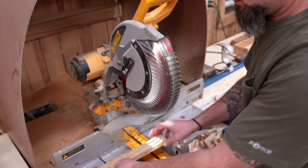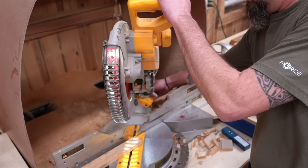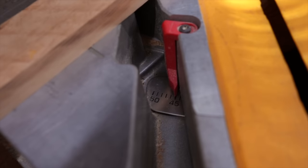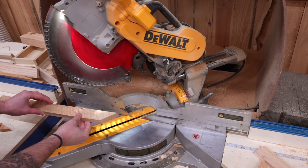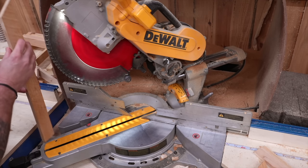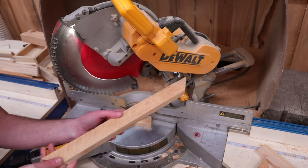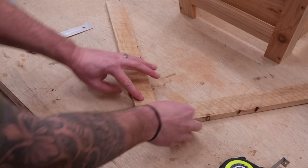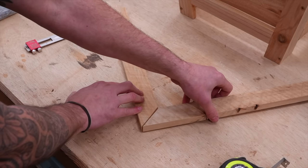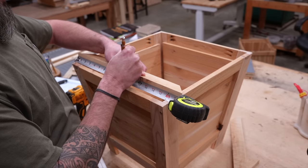To cut our top trim we're going to use a miter bevel — don't freak out, I'll walk you through it. Set your miter at 45 degrees to the left and your bevel at 8 degrees to the left, so your saw plate looks like this: 8 degrees and 45 degrees. These will be labeled Part M on the cut list. Once you've made your first cut, flip the board over leaving the longest points against the fence, then change the bevel to 8 degrees to the right, leaving you with a 17 and three quarter inch board tip to tip. With the boards upside down and the longest parts of the bevel touching each other, when you fold it in it closes the gap, allowing the trim to sit at the same 8 degree angle as the rest of the planter.